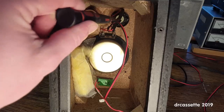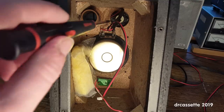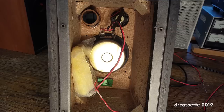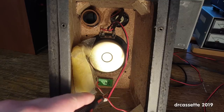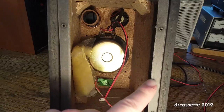The tweeter is not magnetically shielded, but the magnetic field from that tiny little magnet will be so weak I won't have to worry about that. The crossover, rather disappointingly, is just a single capacitor inside heat shrink tubing. The bass reflex port on camera kind of looks like it was made from cardboard, but it's actually made from plastic. There is just a tiny little amount of damping material inside — it's like a cushion glued in, and I wonder if it's even going to do anything. Up front on the circuit board we have the power LED, and at the back where the amplifier module mounts we have a foam gasket as a seal.